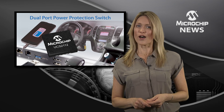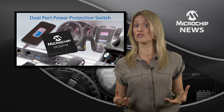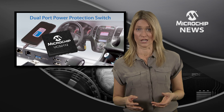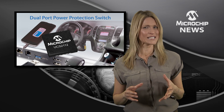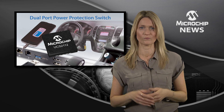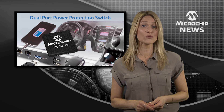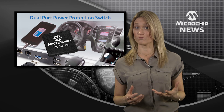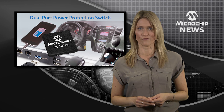There's dynamic thermal management to extend charging operation, integrated current monitoring that measures, reports, and rations charging currents to help intelligently manage the overall charging system and more. The UCS-2112 supports two USB ports with eight programmable continuous current limits of up to three amps for each port.